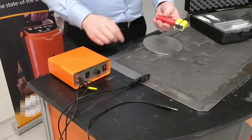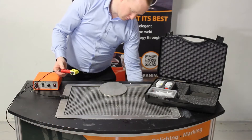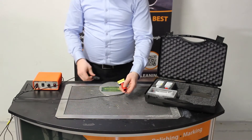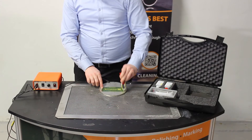Here is the hand stamp with the carbon block and felt already attached with the o-ring. This here is a long life stencil. Attach the clamp to the metal and then simply pass over the top of the stencil to produce the etch on the surface of the metal.